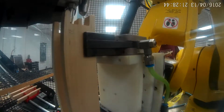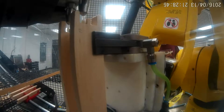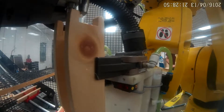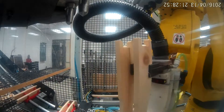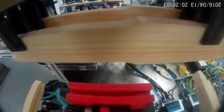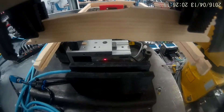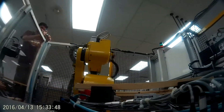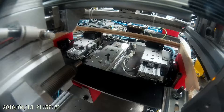In the case of the two end bars, the robot positions the parts to be glued before placing them into the nest and sliding them into the bottom bar. With all wooden components placed, the turntable is able to rotate, positioning the frame to the next station.